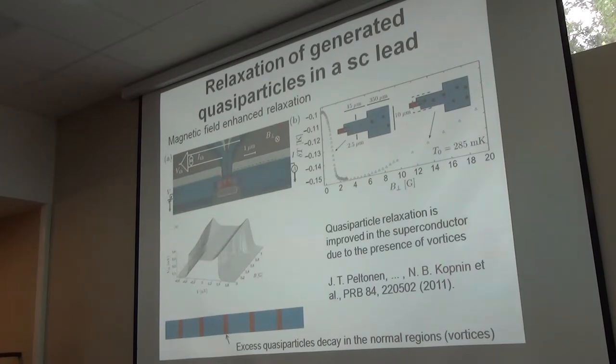The picture, which is very phenomenological and very plausible, is that when you apply that small magnetic field, you create vortices in the aluminum, and vortices, similarly to normal metal in general, act as centers for trapping the excess quasiparticles in this superconductor. So when you increase the magnetic field, of course the density of these vortices increases, and you get further improved performance. But eventually, when the magnetic field increases large enough, the vortices start to penetrate close to these junctions here,